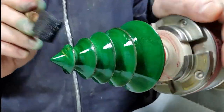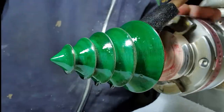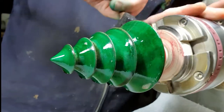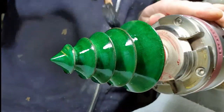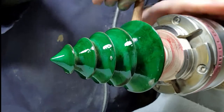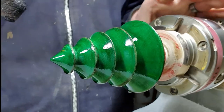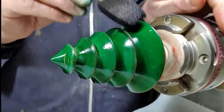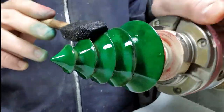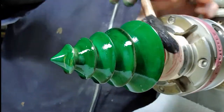Now this is done — we'll let this dry. It's best to let it dry naturally, because if you use a heat source you're going to be evaporating all of this off the surface before it's had any chance of getting into the pores of the wood. Get it nice and shiny and wet, don't worry about the bubbles, and then just let it dry. If you're anything like me and haven't got the patience to wait, and you want to use a heat source, at least give it five minutes to let the juice get in there. Go put the kettle on, make a cup of tea. We'll leave that to dry and come back as soon as it's ready.